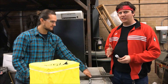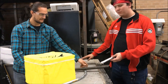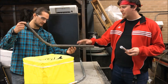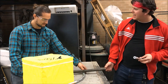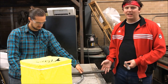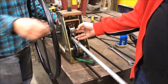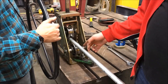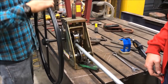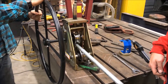For the actual actuation of the gripper, we have a cylinder attached to two bars. The bars aren't fully bent or drilled yet, but we're using an inch-and-a-half diameter steel piece we found as scrap, and an inch-diameter piece of conduit. There are three rollers — two are stationary and one is driven on the wheel with a lead screw that forces it into the middle of the other two, creating a kink. The idea is that you can roll that kink across the section for longer, very even-curvature bends.